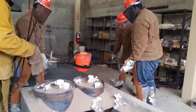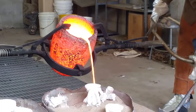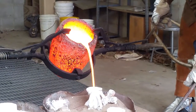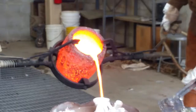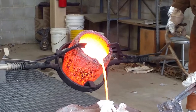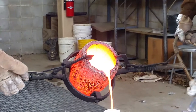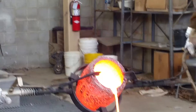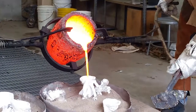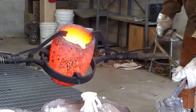I hope the tips will be 6 o'clock. Tyler, you okay? Yeah. We're going to pour it. Pour it a little faster. We've got a big mold. Let's not miss any speed. And we're stopping right now. If you ever see the sand move like that, it's cracked. Keep pouring. I'm saying it should help stop the flow. Slow. Stop.